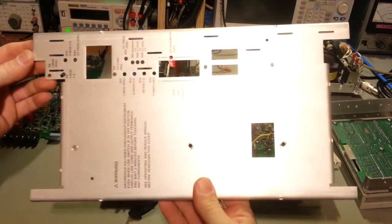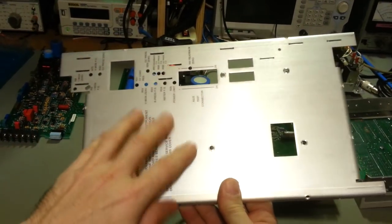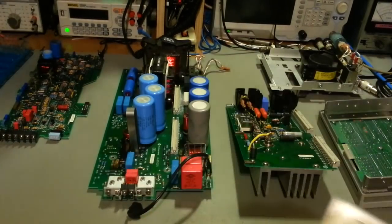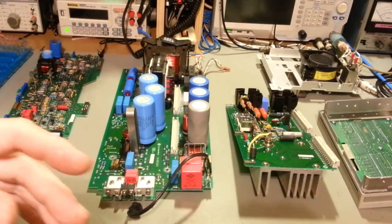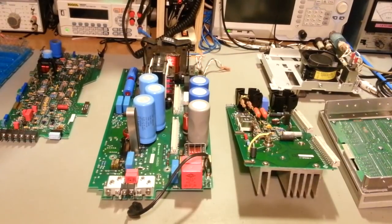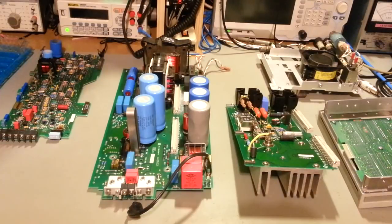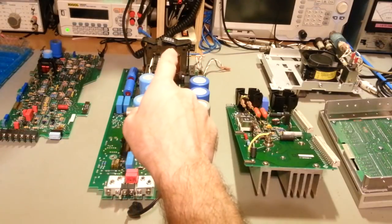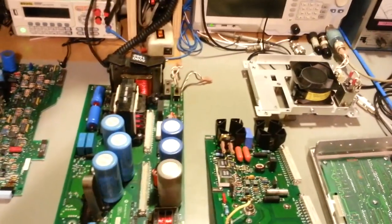Sitting on top of that substructure, when you first take the top cover off, you see this, which has some of the information about the power supply and the adjustments for when you're calibrating one of these. But calibration potentiometers ain't going to do me much good, because when I turned it on, it didn't do anything. As soon as I got the main top cover off, I could instantly see what's wrong, and you can see it in the camera. You may not realize it, but it's there. It's that transformer all the way in the back there, it's broken. Yep, it got damaged in shipping.